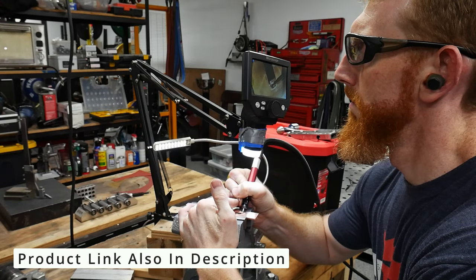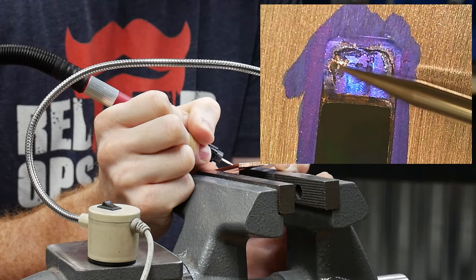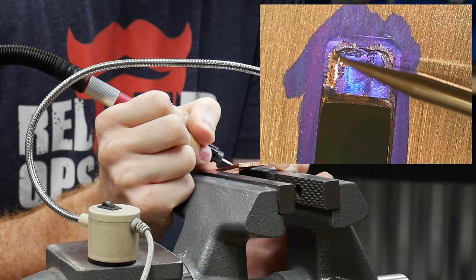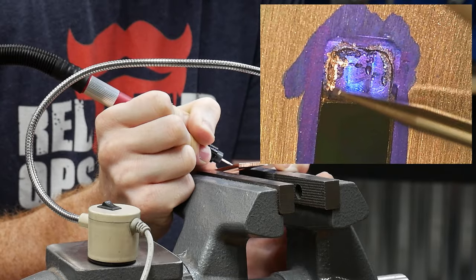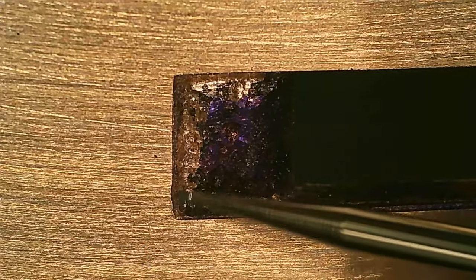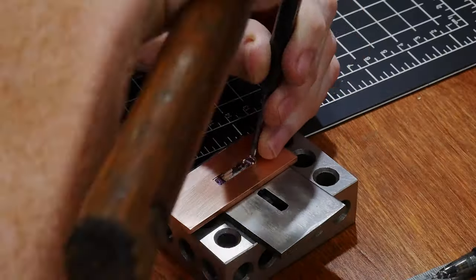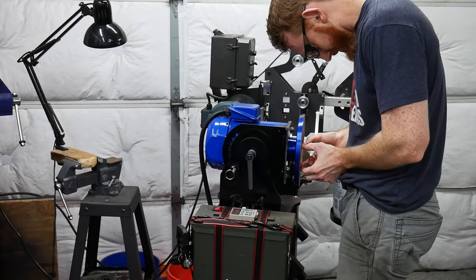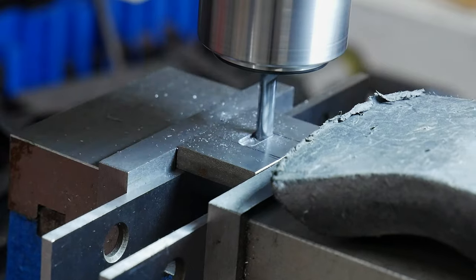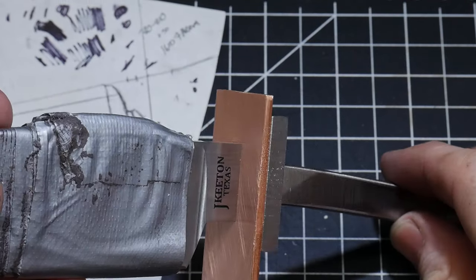This time around I decided to up my game with a cheap microscope in order to really see what I'm doing with the rotary burr. This $70 microscope isn't anything to write home about but it gets the job done, with a pretty large focal window and a screen big enough to see what's going on. I mounted mine to an old microphone boom with a pipe clamp. I think part of my guard fitting issues were due to opening up the slot too much with files, which allowed the guard to move up and down, leading to unwanted indentations at the top and bottom when hammering. At this point I had the fit looking pretty good with some slight gapping at the top, which I attempted to close with some targeted peening to move material back towards the ricasso. This worked decently and the gap at the top was closed. We now have the copper guard fit up over the ricasso and a stainless front spacer fit to the tang as well.